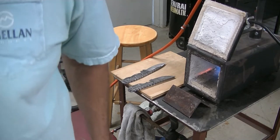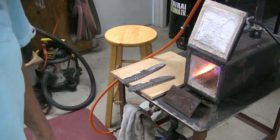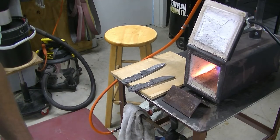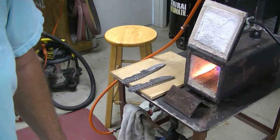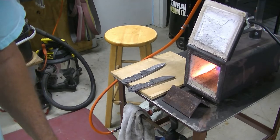I have two burners in there. I'm going to run both burners just to get the forge good and hot, and then I'll just switch to one burner so we don't overheat the blade. Additionally, what I'm going to do is warm up my oil. I have vegetable oil that I use for cooling, and I need to get that over 100 degrees — probably somewhere around 110 to 115 degrees. That'll be our quenching oil. If you put it in too cold, you're not going to get a good heat treat.